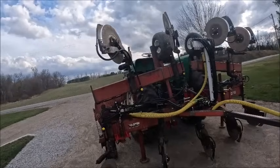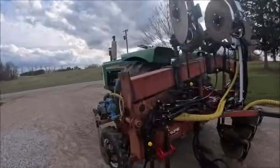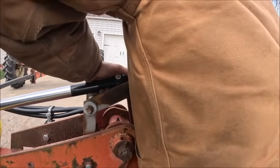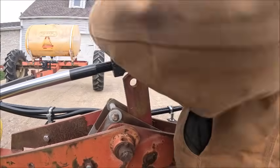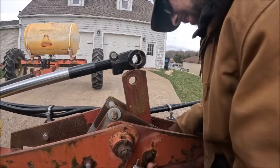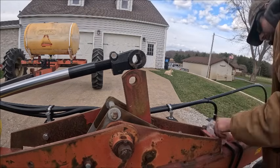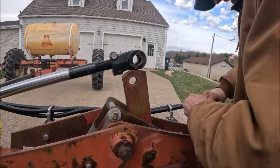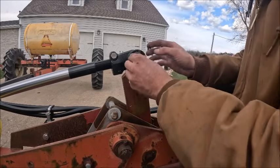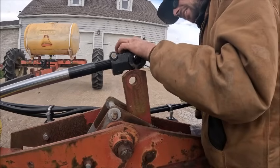I guess I can unfold real quick and we can change out those cylinder pins. Or the bushings, I mean. Got my homemade ones. And then these are actual ones, they're spring loaded so that they'll drive in there and not move around, and that's what these are actually made to do, is bush cylinder pins down.